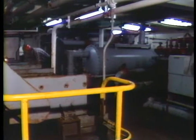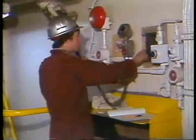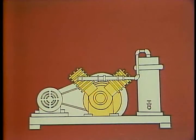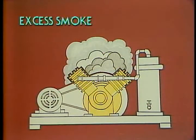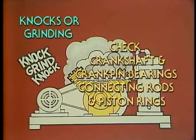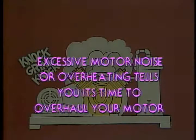If the degasser becomes clogged with mud, run some clean mud through the unit and then stop the degasser and wash with water. If the vessel is washed with water, make sure the discharge is to the waste pit, or keep track of how many gallons of water were added to the circulating mud system — be sure to let the driller know when you add anything to the system. For vacuum pump and motor problems: if excess smoke is coming out of the exhaust, it's time to replace the piston rings. If the pump makes continuous loud knocks or grinding noises, check the crankshaft and crank pin bearings, connecting rods, and piston rings, and replace them if necessary. Excessive motor noise or overheating tells you it's time to overhaul your motor. If you see barite buildup on the intake port, clean it off to keep it from plugging.